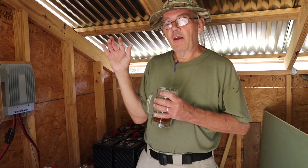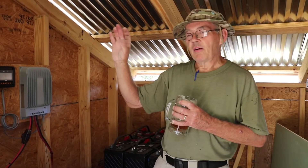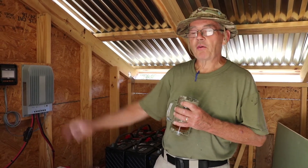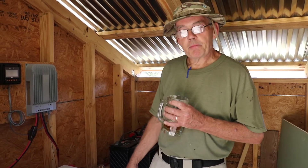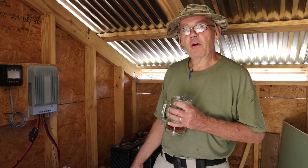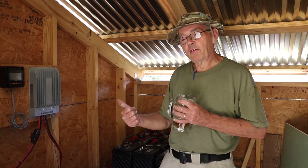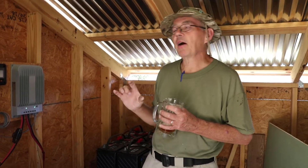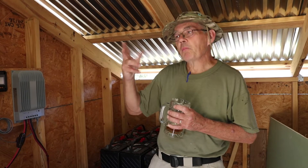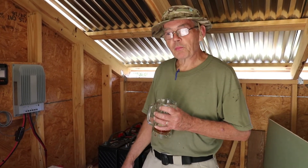The lighting is LED, which is a great thing for off-gridders because it uses so little power. I've got three lights at about 19 watts each, so if all three lights are on — one light per room for three rooms — you've got only 60 watts. So the fridge doesn't take much, the lighting doesn't take much, the microwave is a real power hog but luckily you only use it for a few seconds at a time. The AC is moderate, but it cools down quickly because the floor footprint is so small.